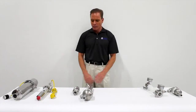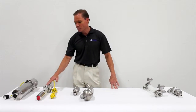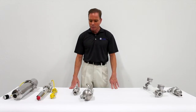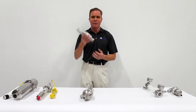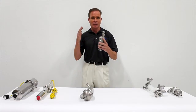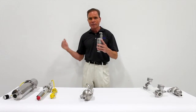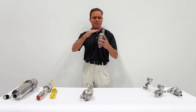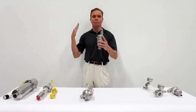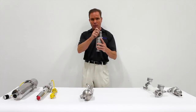Next we're going to talk about the degassing requirements of the ozone contact system. We already talked about the destructs and how important it is that they do not see any liquid water. We address this with a degassing system that starts with a vent valve. The vent valve is a very simple device that incorporates a float. Normally the tank is full and the float is forced to the top, closing the valve. But when gas that does not dissolve travels to the top of the tank, the float falls momentarily, causing the gas to expel under pressure.